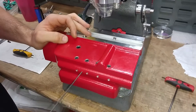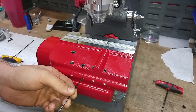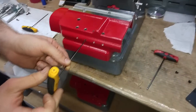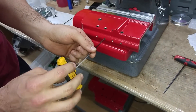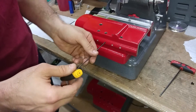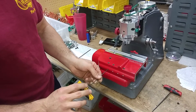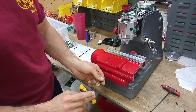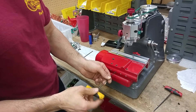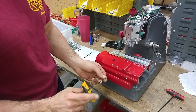Now we're going to re-tighten these screws. Remember, we loosened them one quarter of a turn and we want to tighten them the same way. Do not over-tighten these screws. If you go to the end of the T-handle, I'm just using my fingertips to tighten this — I'm not actually grabbing it. This is a very sensitive part of the machine. The table is all the way to the right side. We're going to very lightly tighten these back to that quarter of a turn. As soon as I feel pressure on the screw, I'm done — no more tightening. You should never over-tighten it. You should never hear a popping sound when you come back off. As soon as it touches, you're done.